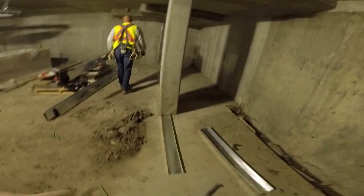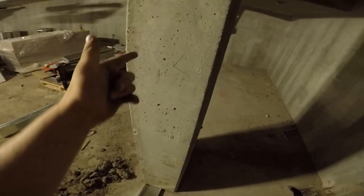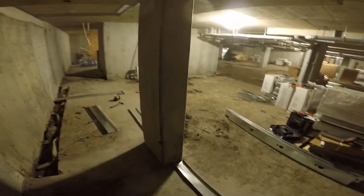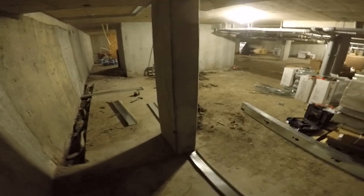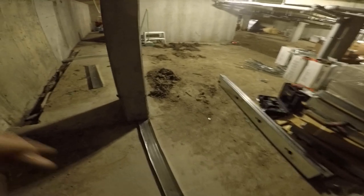It's also important to shoot all your wall studs in before you stud out your wall, because then you can get your gun in nice and comfortable. So do your perimeter — shoot in your top track, bottom track, and your wall studs. And if the wall studs are into drywall, then screw them off. But make sure they're fastened before you start studding out the wall so you have good access to it.